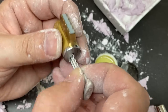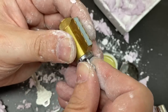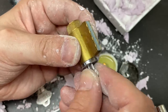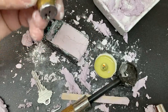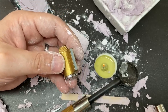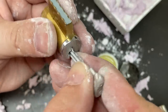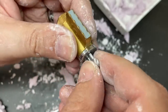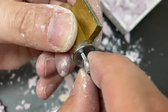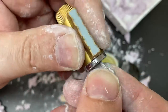Okay, seems hard enough. Let's see if that can be released. Now that is a partial cast — but it could honestly be good enough. After cleaning it up a bit — it's not perfect, but look at that. Compare that to the actual key — it could work. Just need to get you in the lock. The original key works absolutely fine, and this should too.